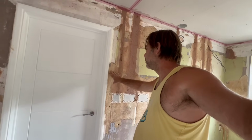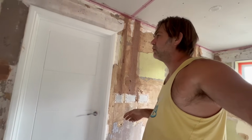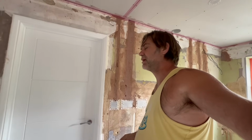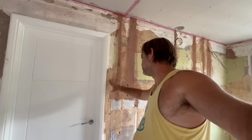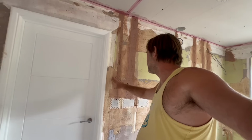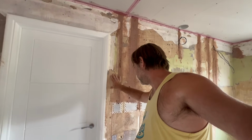Now I've just gone around the room and I've come back to the beginning and that's pretty much dry. So when I'm PVAing, you can leave a little bit of suction in there, which helps speed up the set time. So basically when you're coming around, you want that PVA or SBR staying wet on there for around 10 minutes or so, because if you put PVA on something and it dries in straight away, you haven't killed enough suction. Same as SBR really. Get another coat of it on there.